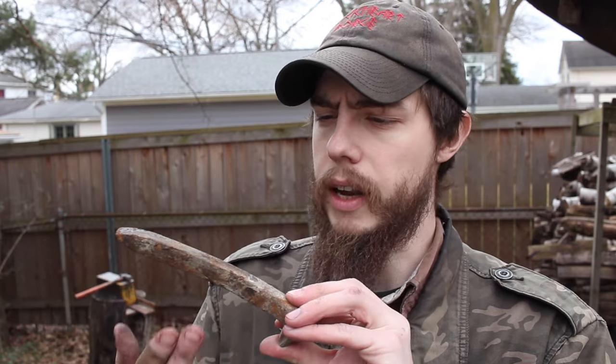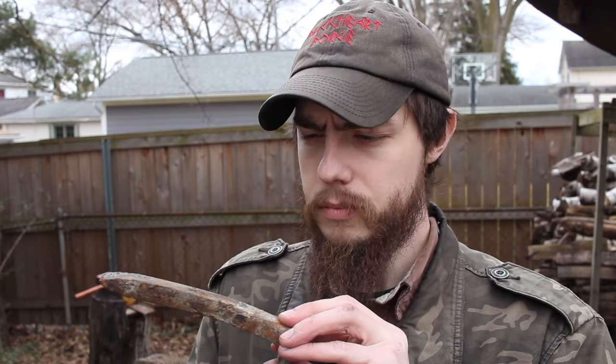For a spike hawk, this will be the head and this will be the spike, so I've got to make a hole in the center and drift that out. What I think I'm going to do is use my angle grinder to cut maybe all the way through, or at least most of the way through. I don't want to chisel all the way through because that's going to shorten the material and make this area real thin in the head, which aesthetically I don't think looks as good.